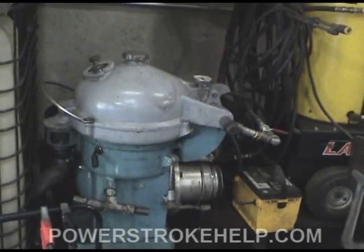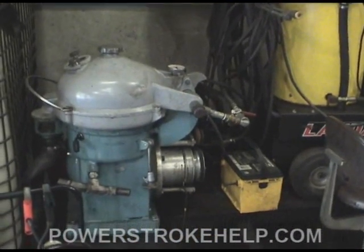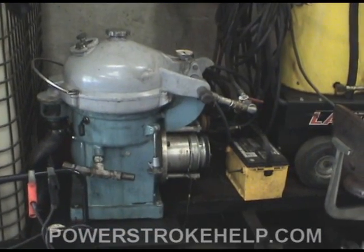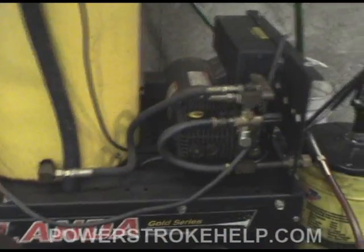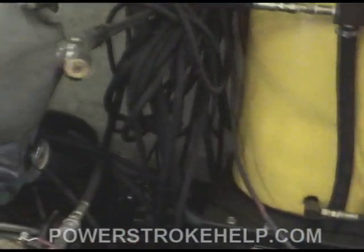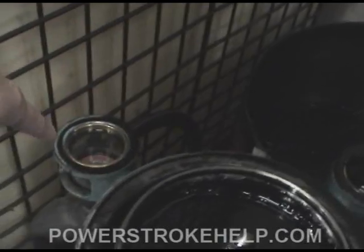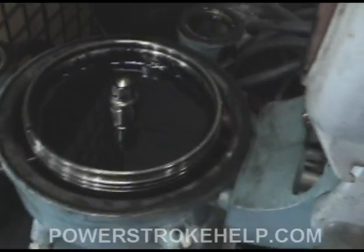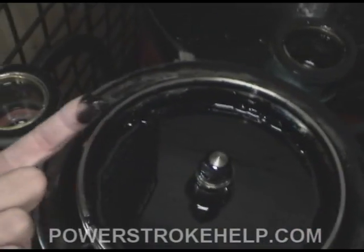One of the other things I have sitting in the corner of my shop — part of the experimental process when diesel fuel hit $5 a gallon — is a centrifuge. This is a marine-style centrifuge. We had a dedicated hot water pressure washer that we'd run the fuel through, and then it went into the centrifuge, spun at 10,000 RPM. Your fuel comes out on the top end, your water comes out over here, and you can see the sludge.